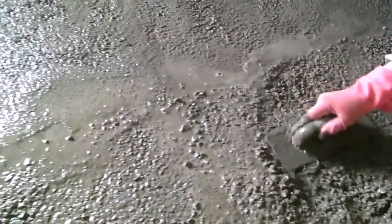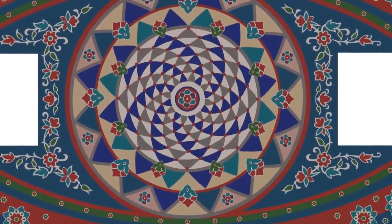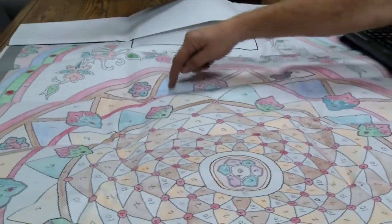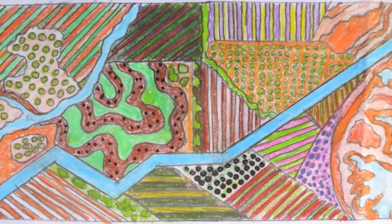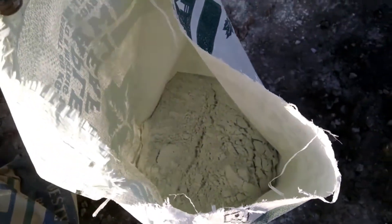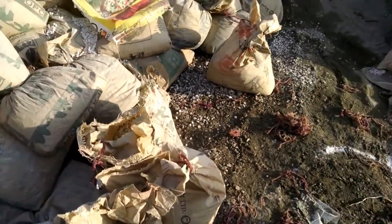Step 2: Design Layout. The next step prior to pouring terrazzo is the design layout. Terrazzo is an art form that uses divider strips that serve to control expansion joints and separate multiple epoxy resin colors. Divider strips can be coordinated to create complex design patterns or even the most amusing floor designs. Before commencing a pavement, one must consider what the space or room will be used for, color selection, and patterns. In wet areas, certain falls are required by legislation to assist water to drain away into a floor grate fixed by plumbers before the concrete process. Several types of marble chips may be chosen for size and hardness.